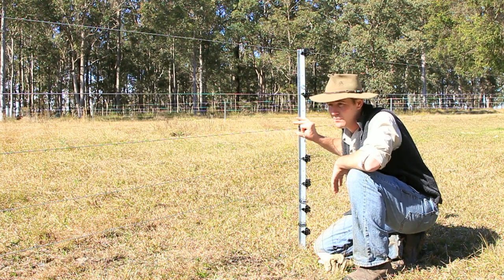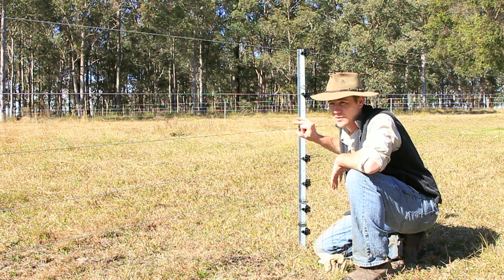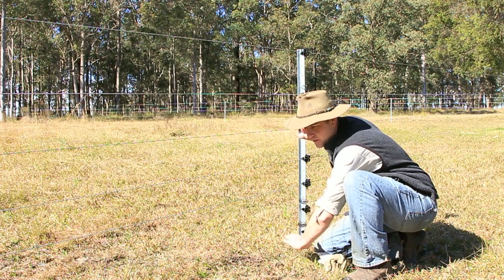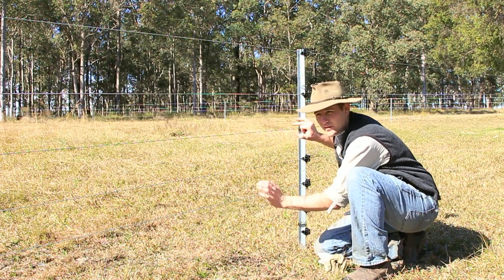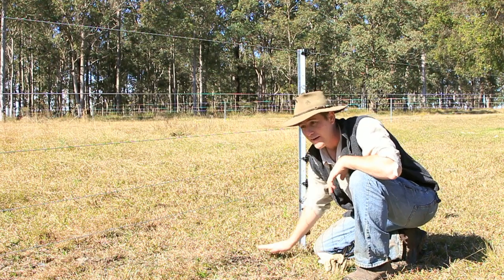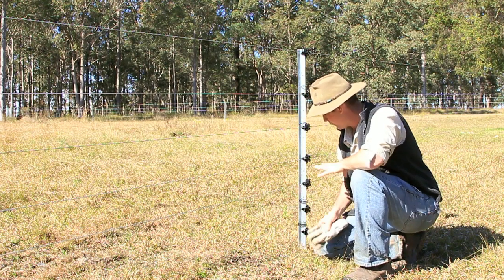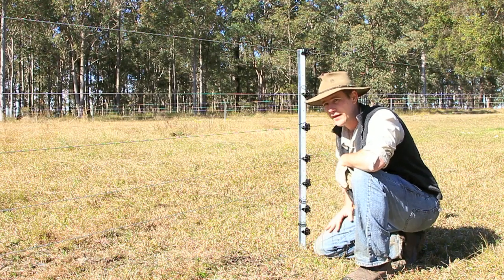But compared to putting in timber with four strands of barbed wire, this is a quite economical fence that'll probably see me out — it should last quite a long time, and will be easy to maintain, easy to keep the bladey grass from growing up through the fence, because I won't have netting coming all the way down to the ground with vertical wires, so I can get a whipper snipper or a mulcher mower edge in underneath that bottom wire and cut, or I can spray. I hope that gives you a bit of an idea of how I'm putting that together. We'll see you later.